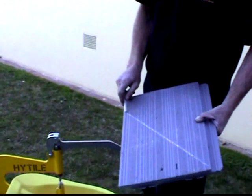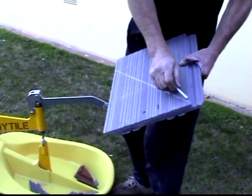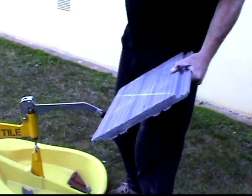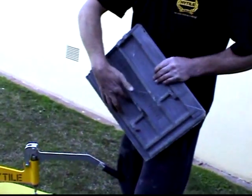In Australia, that's called a water course and a cover flange. We avoid hitting that with the cutter. We stick to the main body of the tile and it should break perfectly. And remember to avoid the under ribs under the tile.